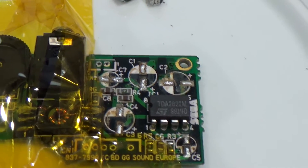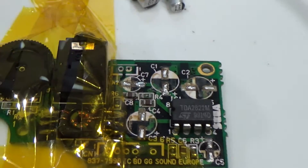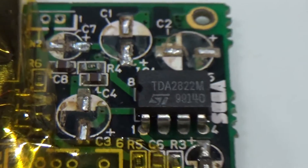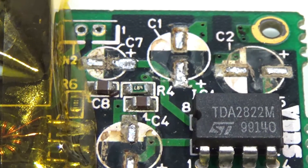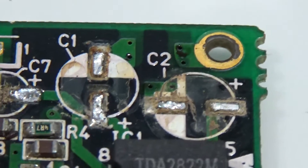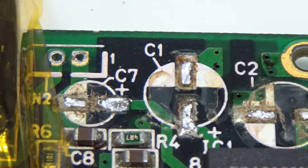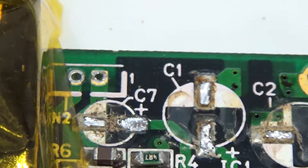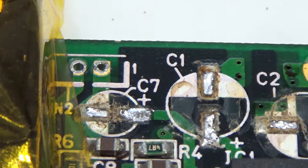It did smell really bad when they were coming off, but I've been quite careful taking those off, so the pads are all alright. I'm just gonna cover this up with something to stop it from getting hot, and then it's just a case of getting the hot air to these caps and ripping them off. The hot air got those off quite easily without appearing to do any damage. They came off very easily and they smell horrible — look at the disgust that's under there. That is horrible.